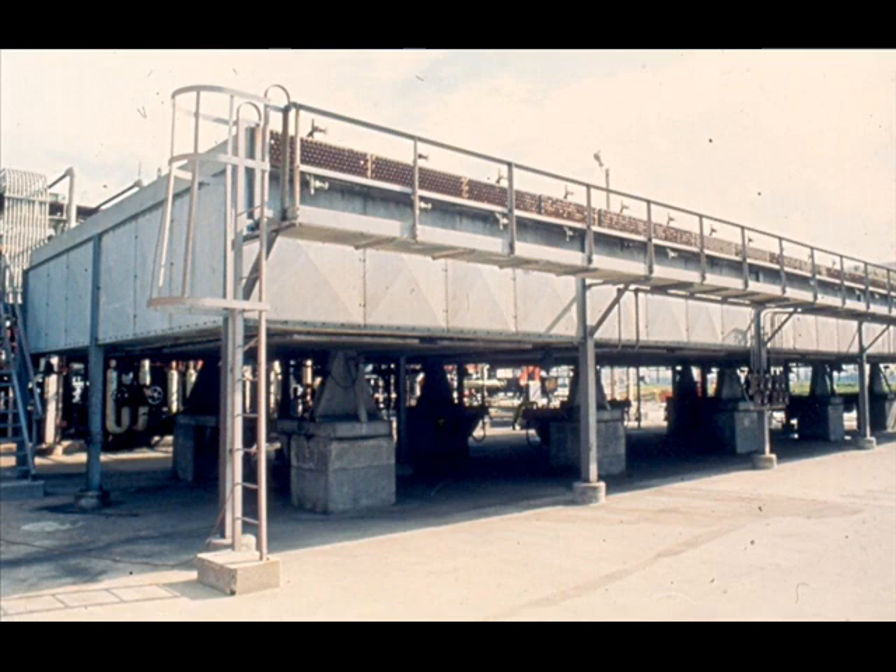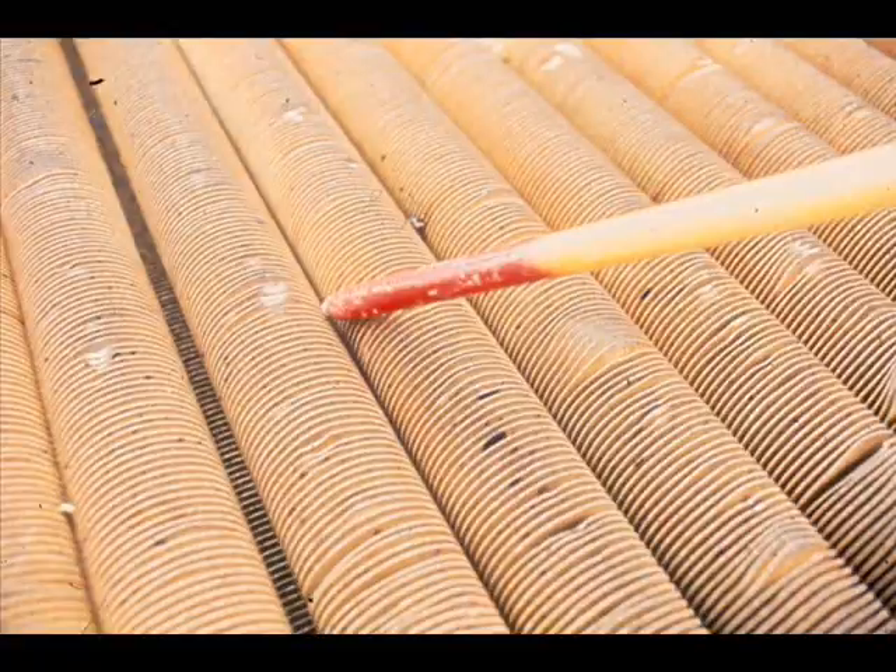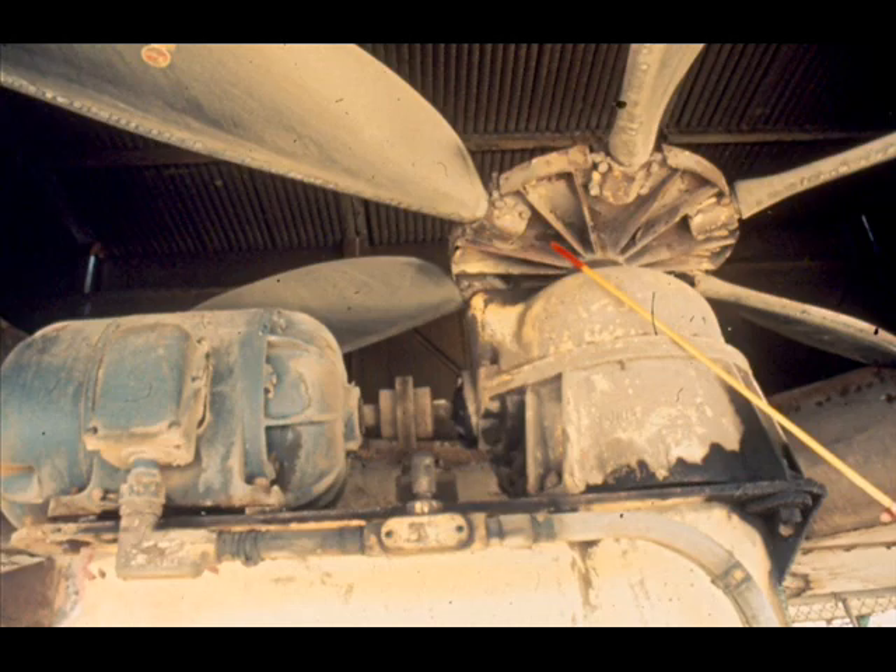This apparatus is practically identical in operation to a radiator on your automobile. The liquid to be cooled is pumped through tubes, being pointed out here. Metal fins connect to the tubes, dissipating the heat from the metal tubes. In turn, the fins are cooled by the air blown across them by the cooling fan. As you can see, both units are used for cooling a liquid, and both units use a different principle.